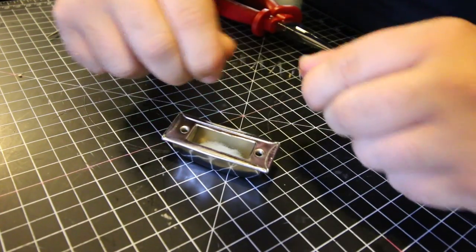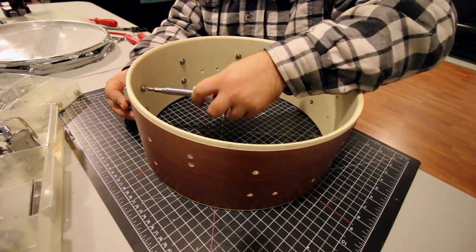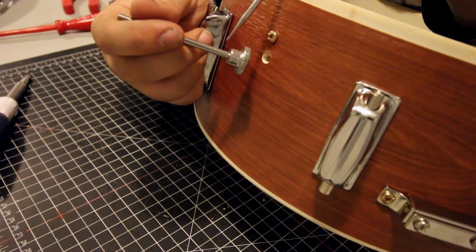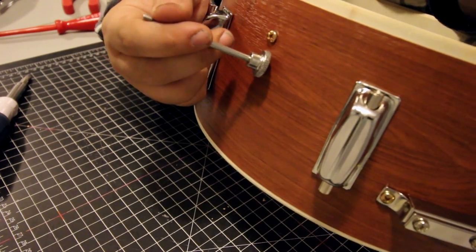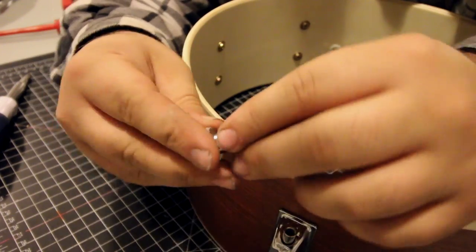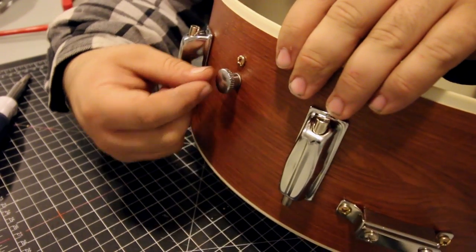Fixing loose springs is as simple as just stretching out the spring a little bit. I'm using a pick with a 90-degree bend to put the swivel nuts back in the lug, and then with the cotton ball and swivel nuts in place, I take a pair of needle-nose pliers, compress the spring, and poke it back in the lug. The adjustment screw for the muffler had no washer on it, so it was just the screw bearing on the wrap, which over time would probably wear it out. So I found a very small washer that fits over it — now the washer bears on the wrap and it should not wear out as fast. It turns a whole lot easier now too.